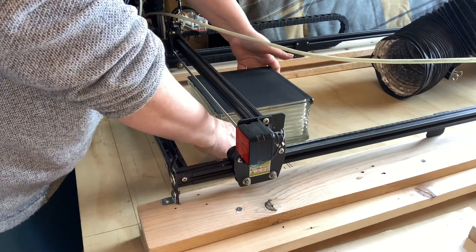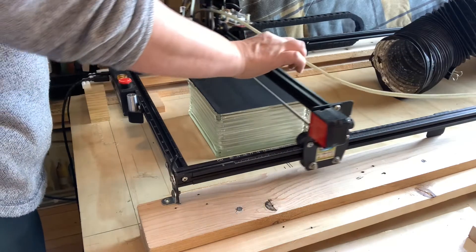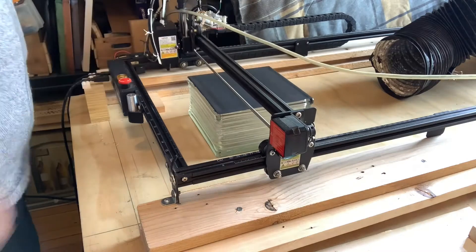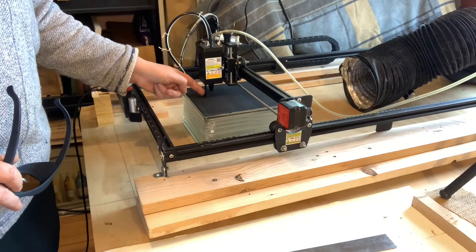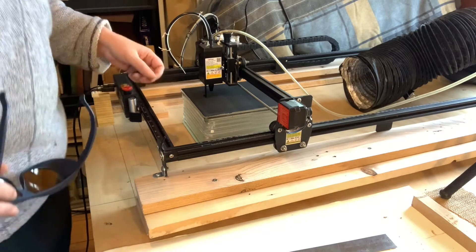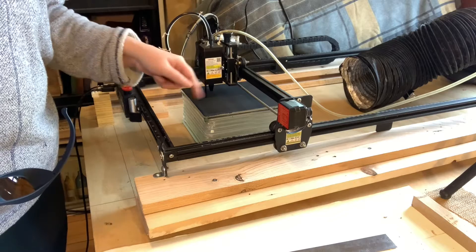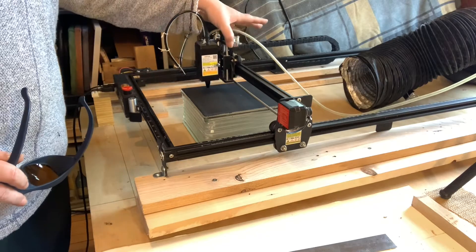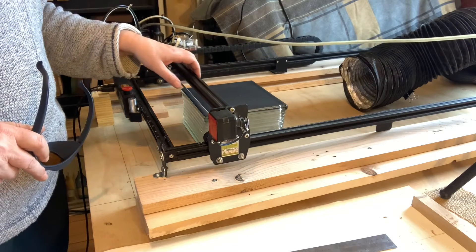Your five-millimeter rod needs to clear anything you're engraving. I've got my new 10W laser attached, but I'm going to go over settings you can use for your 5.5-watt laser as well. The nice thing about the 10-watt laser is it's got a slide-down feature for focusing. I've used my Z-height adjuster and also the sliding tool, which lets it go lower when using thinner materials, so I can have my laser as high or as low as I want.